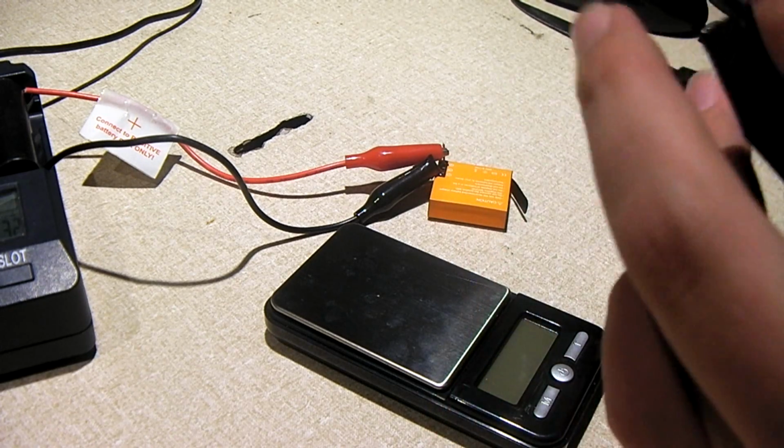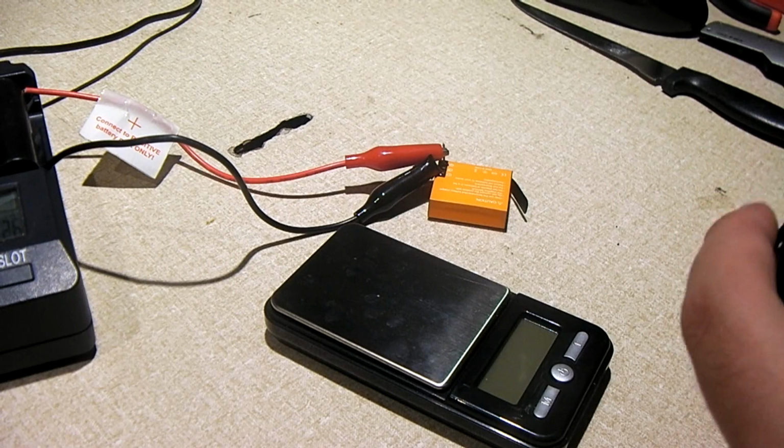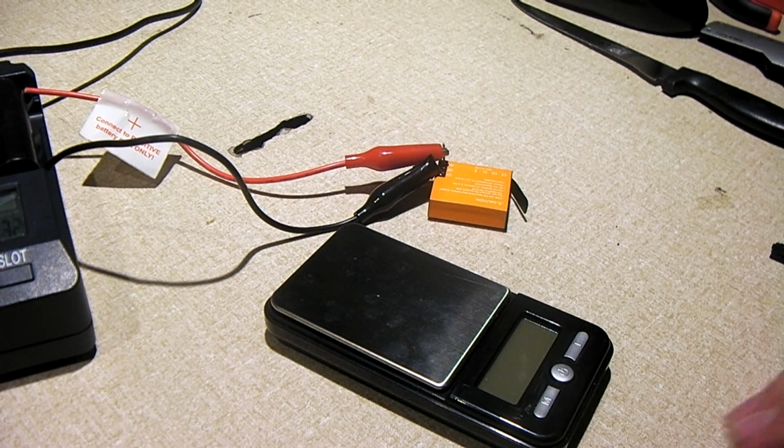The little indicator said it wasn't exactly full. I'll be honest with you guys, I've noticed with a lot of cameras that use lithium-ion batteries, their algorithms for how they handle discharging a lithium-ion cell kind of vary from manufacturer to manufacturer. For example, my Kodak ZI-8 cameras that I use on CubeComp MTDX, well, the ZI-8 that's in the wetter case, and the PlayTouch ZI-10, which goes on the porch, they seem to consider a fully discharged lithium-ion cell to be at about 3 volts.